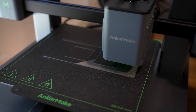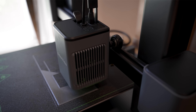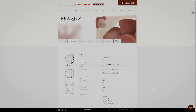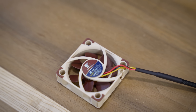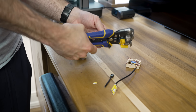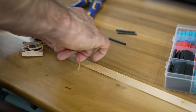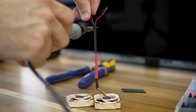So let's talk about what we're printing here. This will be the front grill — not only will it be the aesthetic face of our new console, but it will also be responsible for cooling down the system. Since I had about an hour to kill while it printed, I busied myself by modifying the fans that are going to slot into it: two twin 5-volt 40-millimeter Noctua fans. These should be both whisper quiet and move more than enough air to keep the heat from our little 10-watt system in check. However, they do have two problems. The first was just that their wires were way too long — this was easily remedied with a couple of snips. Then, to bind all the wires together and keep everything inside the case looking neat and organized, I applied a little bit of heat shrink tubing. This stuff shrinks down to half of its original size when you apply some heat to it. Normally I'd use a heat gun, but I forgot it in the shop, so I ended up using the side of my soldering iron, which actually worked quite well.